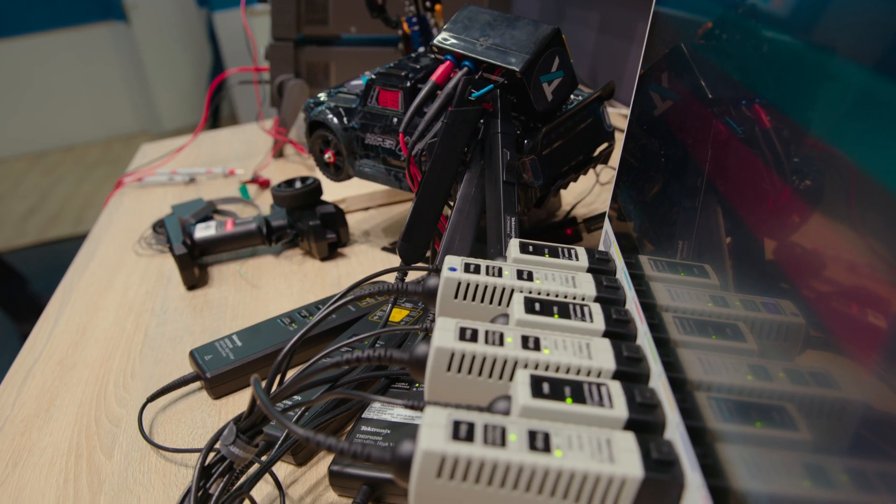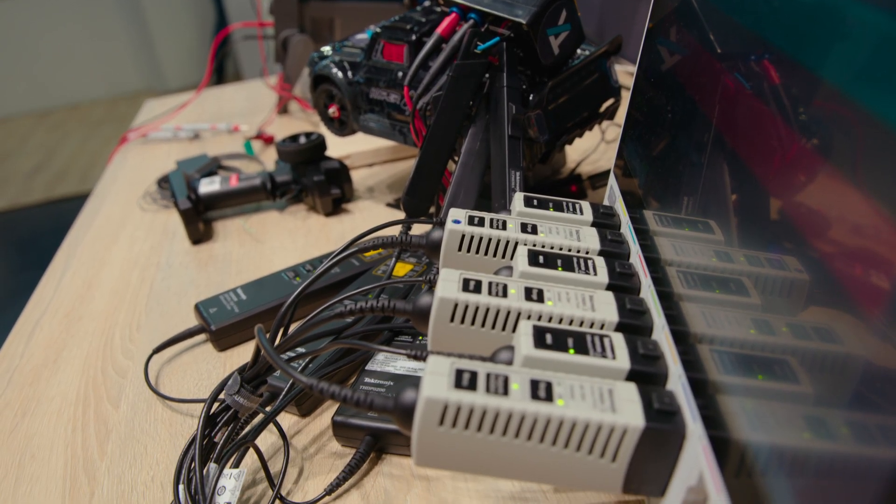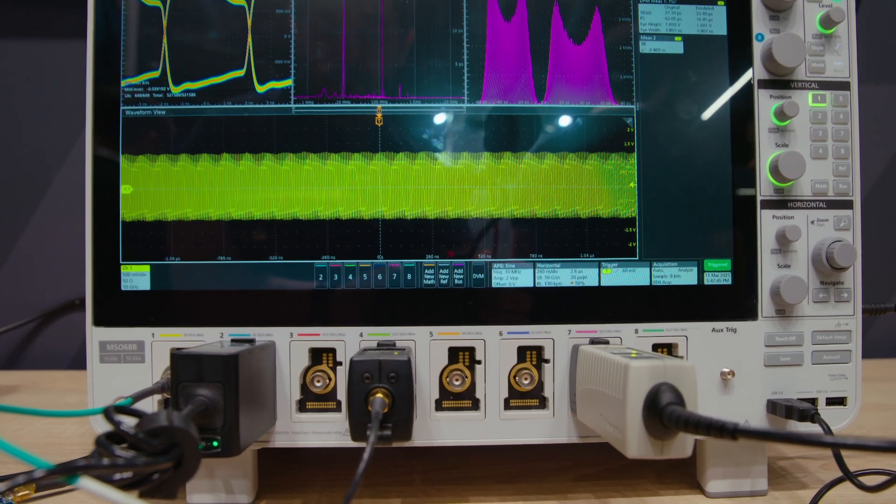Signal fidelity is where all engineers discuss, and there is no unique way to say 'yes, this signal is a real representation of what I see,' because engineers must always know what they are doing. They must know if they are loading the circuit, and what they are using to connect to the test point, because even a small hook or tip going to a square pin may somehow modify the signal. It is anyway a filter — there are parasitics, parasitic capacitances, and inductances in anything you connect.